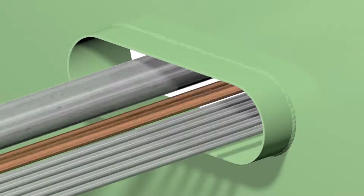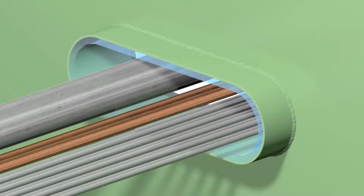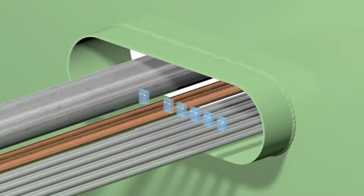The pipes can be ducted through the transit frame in random order. It is most important that they are ducted with no less than the minimum allowable distance to the wall of the conduit frame, and that they are ducted with the required interspacing. An overfill of pipes should be avoided. Please refer to the approval drawings for details.